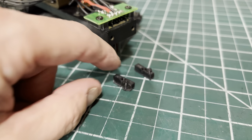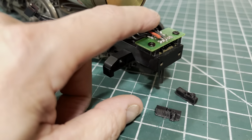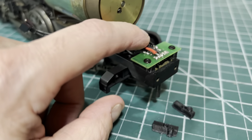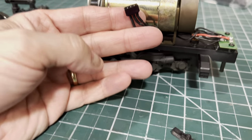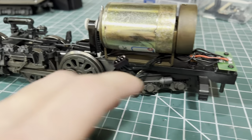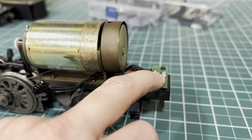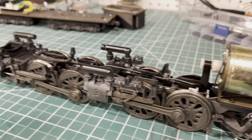And I've 3D printed a couple of adapters for it. So that allows me to get the chuff signal out to the electric railroad boards. And I decided to rewire the locomotive lighting a little bit. Since I have more tether positions, I can now control the lighting with TMCC.